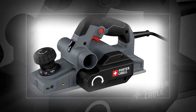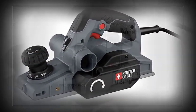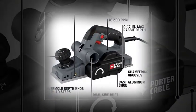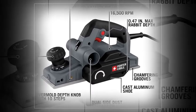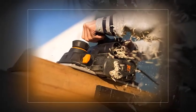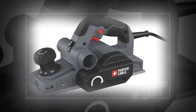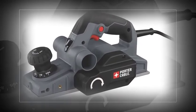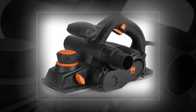Step 6. Rip a wide board. Divide the board into several jointer-sized pieces. Afterward, ensure the board has a straight edge and cut along the grain so it will be less visible when you join them back. Step 7. Use glue to join the board pieces. Once you've jointed and planed the wide board, use some glue to bring it back to one piece. You can plane the board after the glue dries to get the perfect thickness. Also, sanding can help blend the joint with the board and make it less visible.